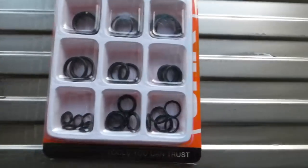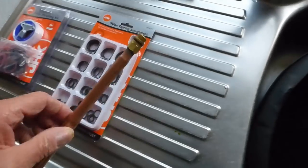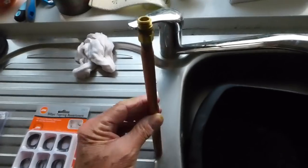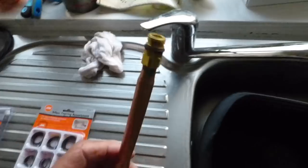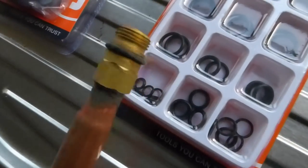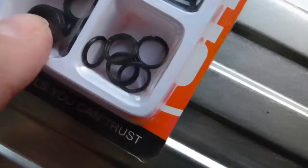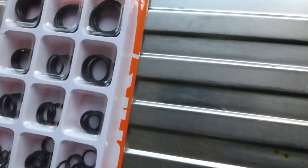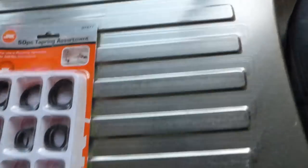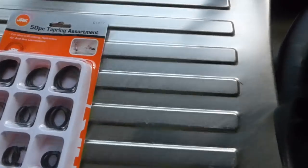So there's a hope that you'd find them in something like this kit. Now here, for instance, is a tap connector. This bit of pipe goes up under the sink and joins onto your tap — it's one of two. What can often leak is this washer here — it's a little rubber O-ring. I know that O-ring is probably this size here, so there you have it. You'd probably have a tough job getting that, but for a pound you've got all these. That's one that often goes on the bottom of these taps — a little joint — and when you undo it you find the rubber washer's gone or got a split in it.